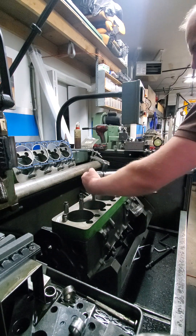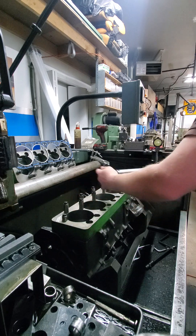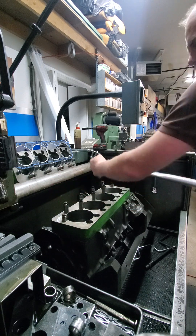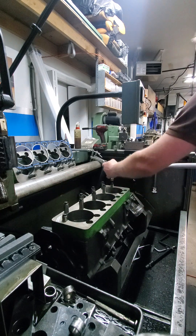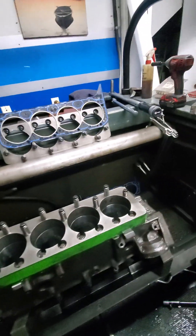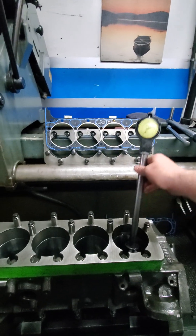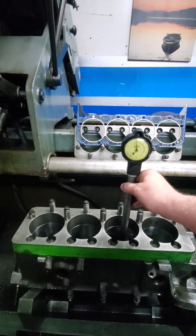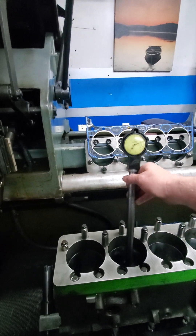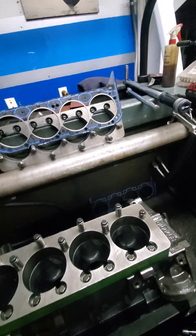I was trying to think of something to say - I lost count, so we're going to do another lap. I was going to do another lap regardless. Let's see if it returned, and how close. At the bottom - zero. One tenth over, zero. I think that's pretty much where it was. Two tenths over, zero. Zero. One tenth tight there. Zero. Looks like a half tenth tight.